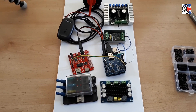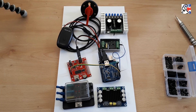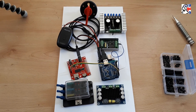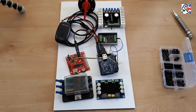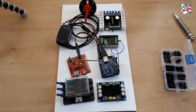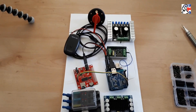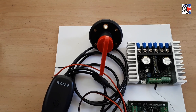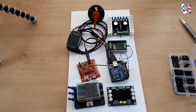When putting together a board for your droid there are some practicalities that really need to be top of your mind. Things like how much space you've actually got — this board is about 22 centimetres across. If you've got space inside your droid then great; if not, do consider using both sides of your board, but make sure it's accessible. For me one of the important things is to make sure I've got a big main switch right near the top so it's easily accessible — that assumes your dome is off, but it makes it nice and easy to flick the power on and off.